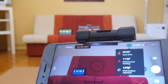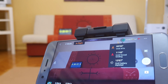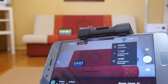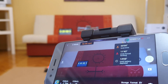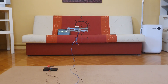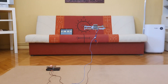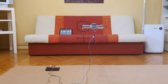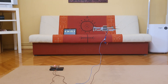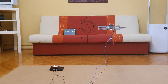Now, if you have a look at the counters here, you see how ridiculously slow they are counting down? 11:45 until force landing, 44:43, and it is stuck for another few seconds here. So it shows that the drone understood that the capacity is much bigger than it should be. But seemingly, the PCB is not reporting any problem, and that can be because part of the charge is coming from those wires and they are not going through the battery's PCB.